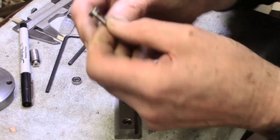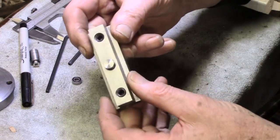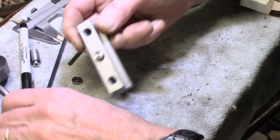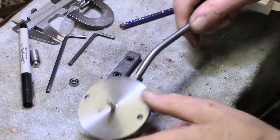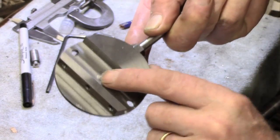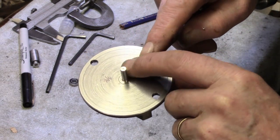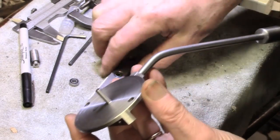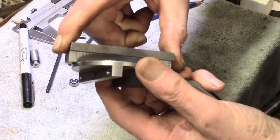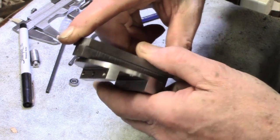We've just made up this little piece here, which is to run inside the bearings. I'm just going to see if I can press this onto the top section. We've pressed that in — that feels pretty good. That was about a thou, one or two thou oversize — pretty tight fit. So now with that and the T-nut, it remains to be seen when it's on the tool post how much slack there is. I doubt if it'll be 100% tight, but it may be better. So we'll try it.